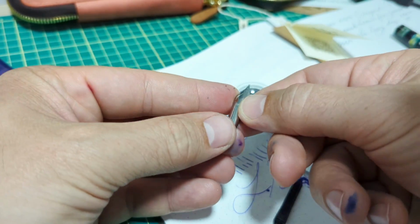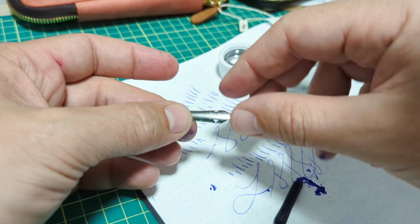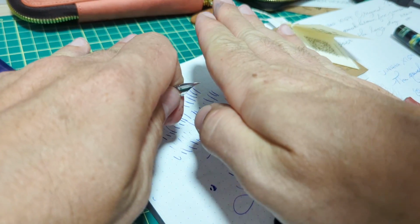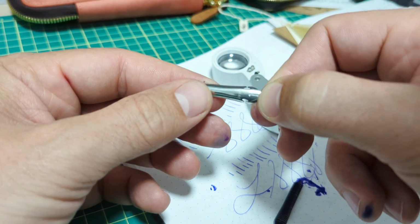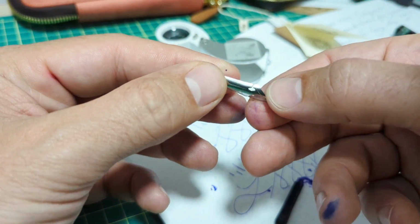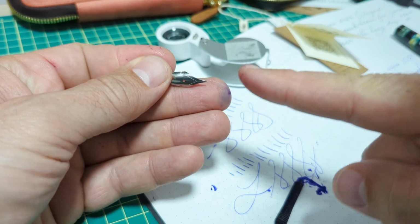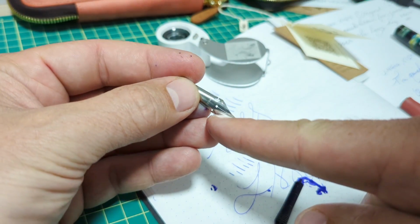Okay, so you start off with a strip of steel. It's punched out and then progressively stamped, right? So there'll be little forms, and then it progressively changes it from flat to not so flat, and all of a sudden you're left with your finished nib. It might be in one shot. It might be multiple, not 100% sure on each manufacturer, could be a little bit different. Regardless, it is finished off like that. It has the shape you see now. The tipping gets welded on, and then you slit the nib.